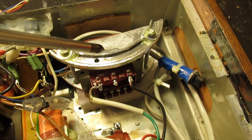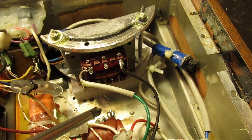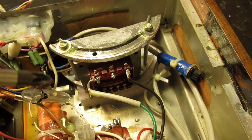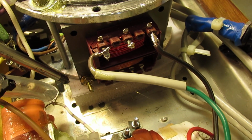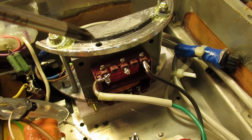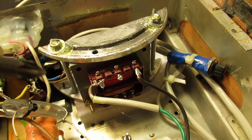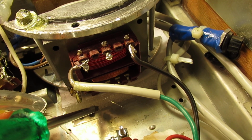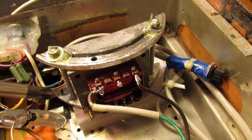Very strange. I found it experimentally in the past. So when you want to mount an audio transformer in an amplifier, mount it in an electrical way isolated from the metal enclosure, the metal box where you want to mount this in. And you can see here there's a kind of foam here, and I've used a kind of silicon cloth here. That's the next thing. A transformer can start to hum. When it hums too much, that's of course very boring, and that's the reason why you can mount this, for instance, on a kind of rubber pad to keep the resonance from the transformer extremely low.